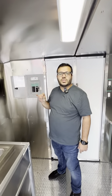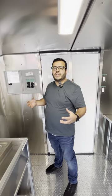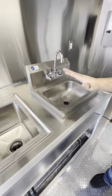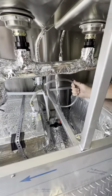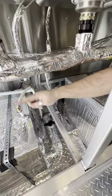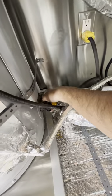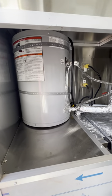Your water heat line is only supposed to be used in the winter. When it's very, very cold, you turn that on and it keeps the water warm. If water or anything freezes, warranty does not cover it, because you're not supposed to have any water inside while it's freezing. This is your single-hand washing sink, this is your three-bay dish washing sink, and your water system is right here. In the winter, you're going to see this nozzle right here — you're going to twist that, put this into anti-freeze, and run that through the lines to make sure the system doesn't freeze and your water heater is not damaged. With the water heater, you have a drain valve right here in the winter — turn the drain valve and the water heater drains out all the way to the floor. In the winter, make sure there's no water inside the water heater or inside the water tanks. You start fresh every single day.